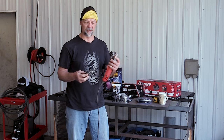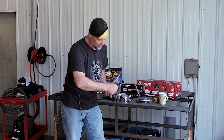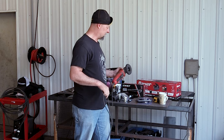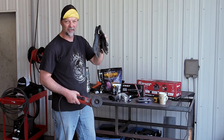You can simply take your nut off the grinder — these have a standard size hub. Stick the wheel on, tighten your nut down, give it a good twist. I usually just do hand tight. You can also use the guard, but with the guard on most of your wheel won't be exposed and it'll be really tough to get into some spots. Make sure you wear gloves because all this stuff is going to be throwing debris everywhere.